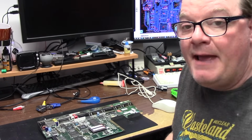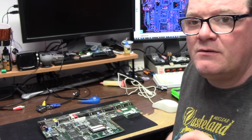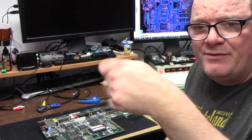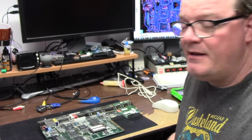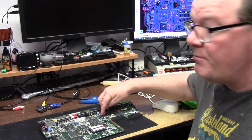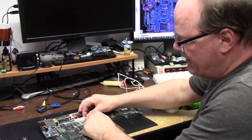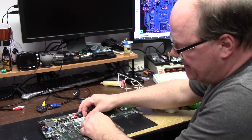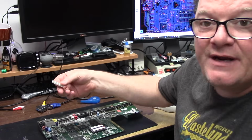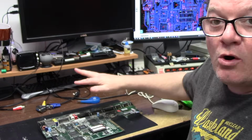If there's any damage to any pads, we'll hit it with a light white vinegar, just for a little flavor. That's also a light acid that reactivates all the goop, and you can then clean that up and neutralize it with IPA. Vinegar helps with removal on certain caps, mainly over here near Paula. That always poops out on me on these 1200s. I've shown in the past how I remove this keyboard thing. It gives you an extra little bit of room in the back to work with.